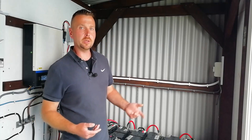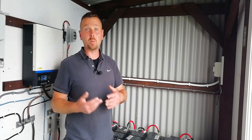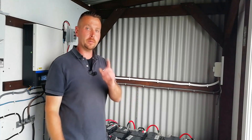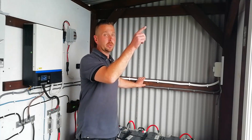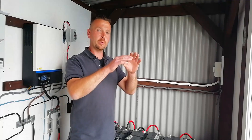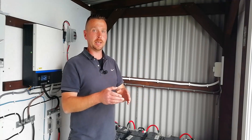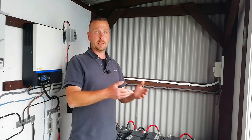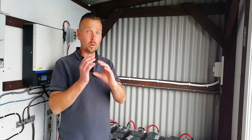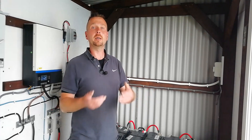The last video we put out and the community post on building the battery bank here seems to have triggered quite a few people who began to fill up the comments section with stuff that wasn't quite accurate or just wasn't true at all. So I want to correct those right now. AC current tends to travel around the outside of the conductor — the metal bit in the middle — this is called the skin effect, and it's because of opposing eddy currents created by the electromagnetic field with AC. DC current however travels through the entire cross section of the wire, not just the middle as was said in one comment. That's the cold hard facts on it.